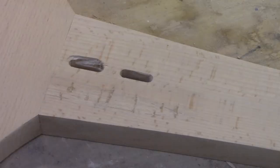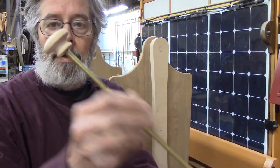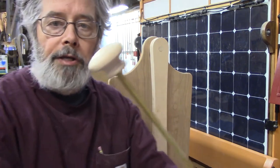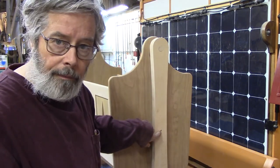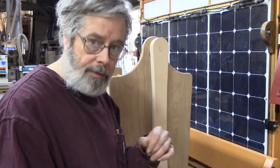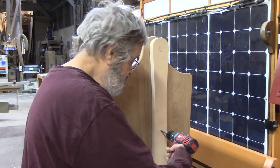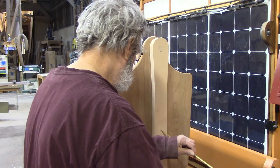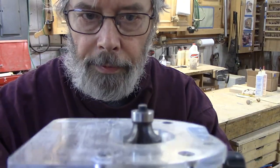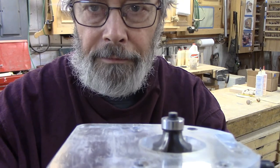So that's it — I'd say we're going to pass that one. One of the things we have to do is finish making this pin right here, which is going to have a brass dowel in it. It's designed to go in through this hole right here and pin this so it doesn't swing in case the baby gets a little too wild. So I'm going to drill through it first — I've got it all ready down to measurement and made sure it's sitting position centered. I've drilled it in that hole, and this goes in to hold it in that location. Next step, we're going to round over the end supports that hold up the cradle itself using the same router and that round-over bit.